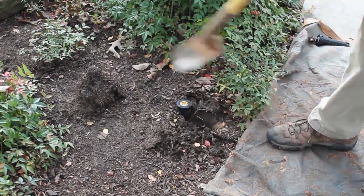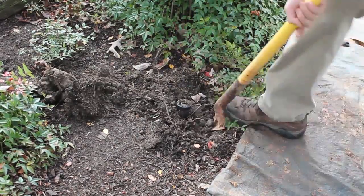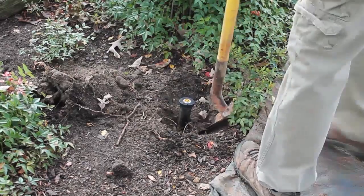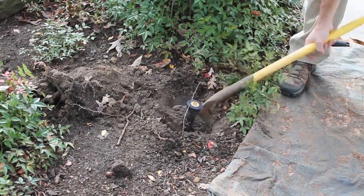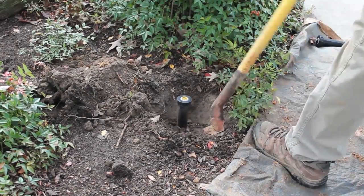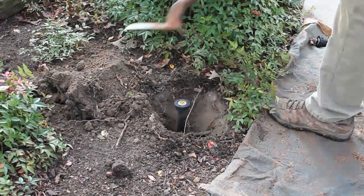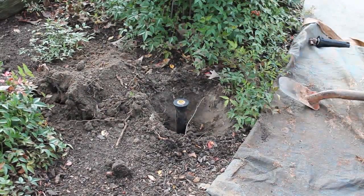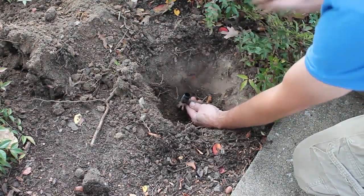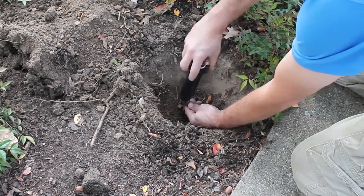Let's take a quick look at a video showing me replacing a spray head with Rain Bird's Retro 1800, which is a drip pressure reducing filter made in the exact same size and form as their 1800 spray head. This is designed to either fully replace a spray head, or you could take out the guts and just drop it into an existing 1800 spray body. But we're going to take the entire thing out because it's a different manufacturer's brand, and we're going to replace it by taking the spray head off its half-inch barb fitting and making sure it's clean.